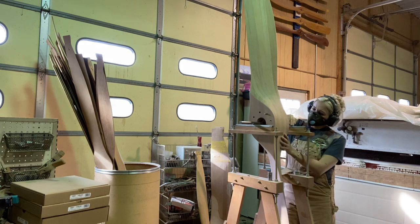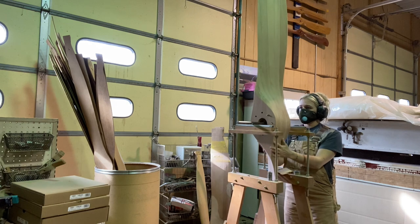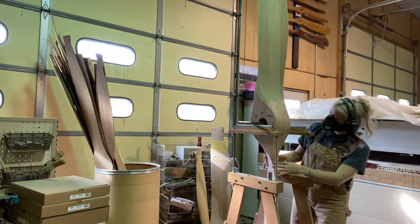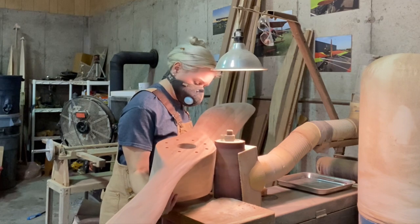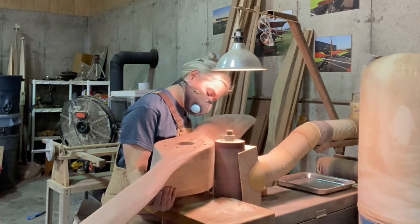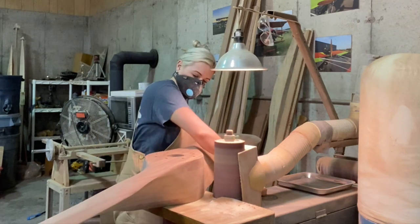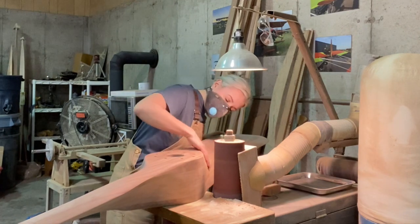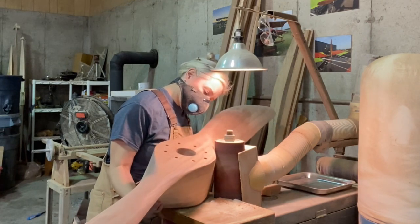There — I don't know if you can see it — but I have some bolts stuck through the bolt pattern. Just like I did the sandpaper on one side, when I do pieces of sandpaper vertical or horizontal I'll stick a bolt through the bolt pattern just to kind of see roughly how much weight I need to take off. It was off quite a bit vertically actually, but you just have to keep working at it.